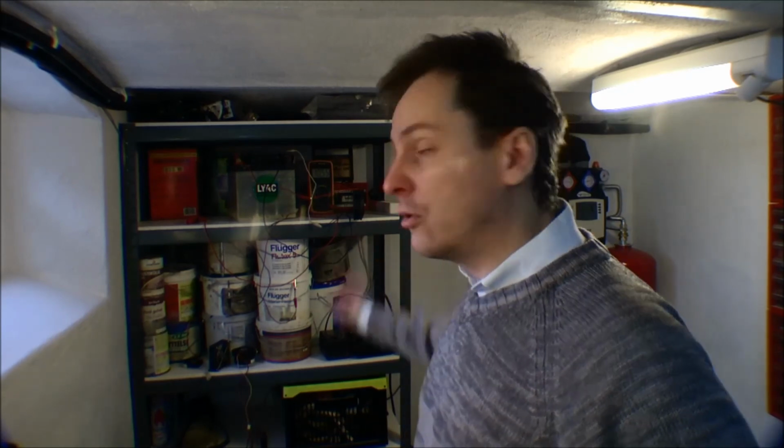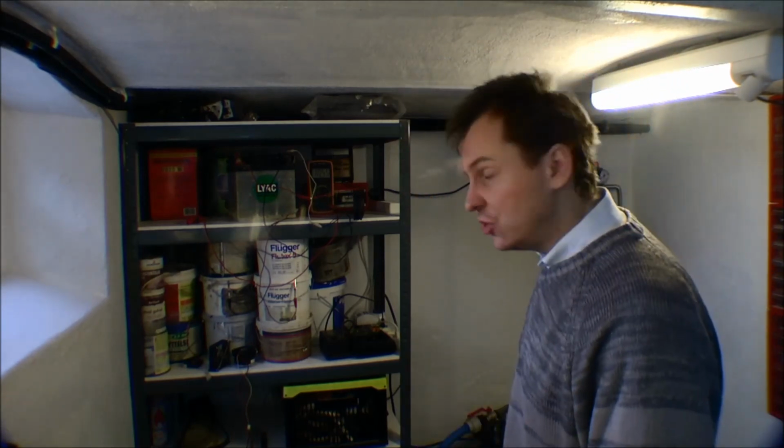So the battery is getting better, but it needs a lot of cycles. It seems like there's probably a bad cell in there. One of the cells is bad, and it's getting a little bit better every time, and I think that discharging it very slowly with these small fans is better than just putting on a big load. But I have to put on a big load to start with, because otherwise I'll never get there. It could run like this for the entire weekend, and I wouldn't get as many cycles. Now I'm gonna put it back on the charger.